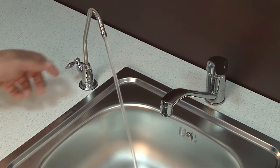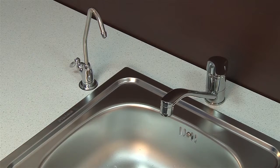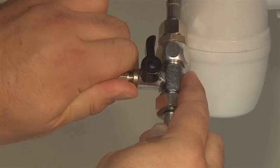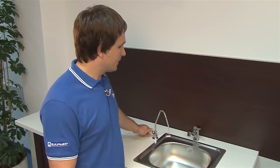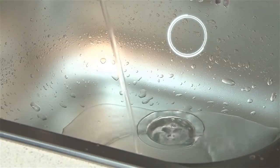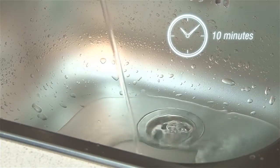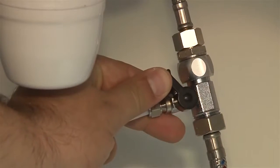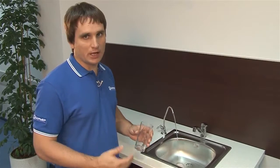Treated water is now available from the clean water faucet. Turn it off and do the final check for leaks under the sink and around the connections. Tighten them if needed. Now open the faucet again. The water could be cloudy or dark looking — it's okay. Even if the water looks pretty clean to the eye, you would still need to rinse the filter and filter elements for 10 minutes. Now adjust the adapter valve to limit the flow of water to around 2 liters or half a gallon a minute.